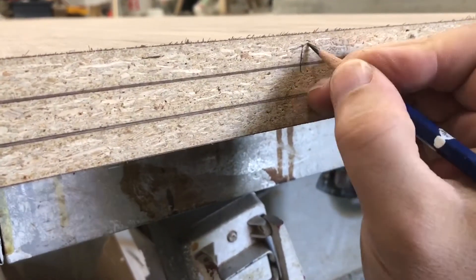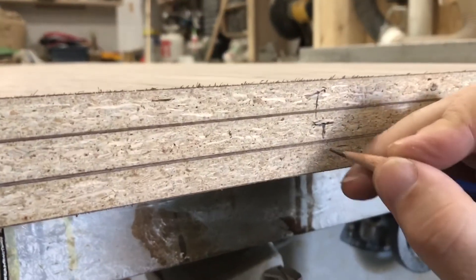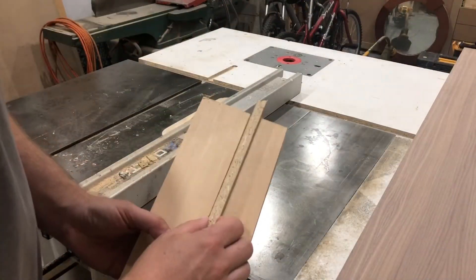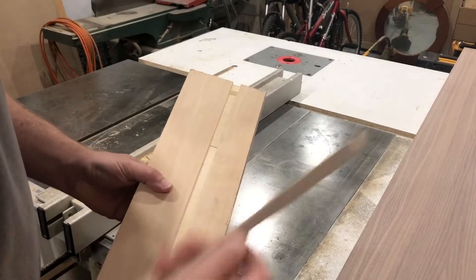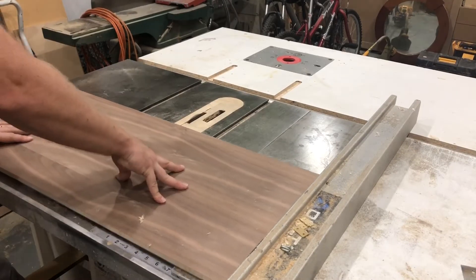The shelving won't be symmetrical, meaning the shelves aren't evenly spaced all the way down. So I want to make sure I mark the top — I'm just putting a pencil mark 'T' for top. That allows me to know where to put the dados. I set up a dado stack for half-inch wide, and I'm just checking it with a piece of scrap material, using the table saw to cut those dados.